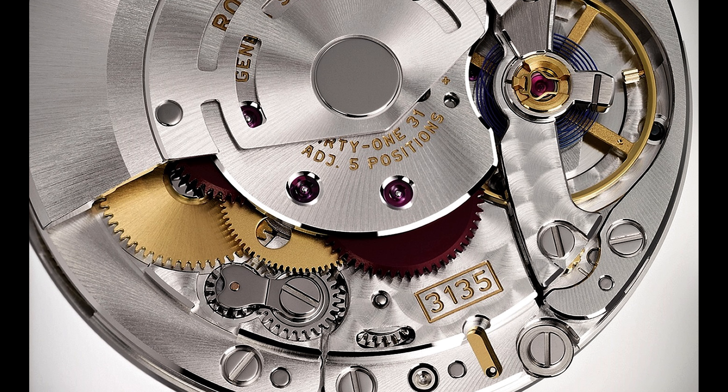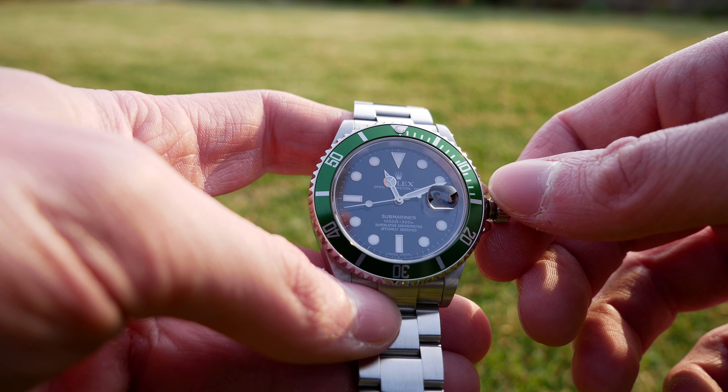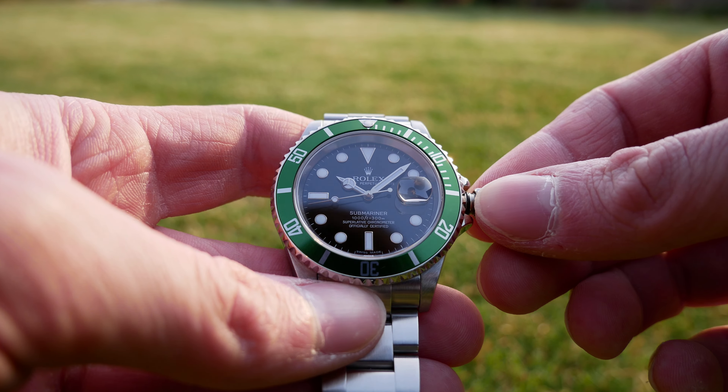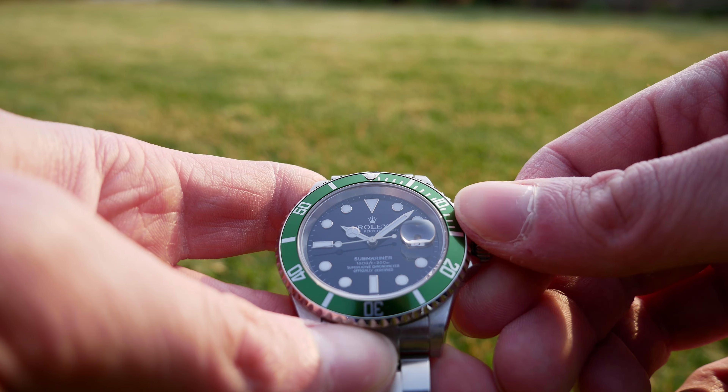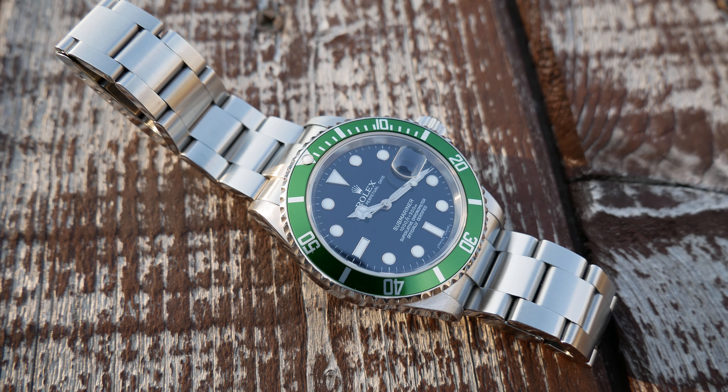The movement inside this Rolex is the in-house caliber 3135, a proven 4 Hz movement with 48 hours of power reserve. This movement is COSC certified and is known for its ability to keep great time for many years without being serviced. I have to say that crown operation on this watch is a bit of a disappointment — setting different crown positions is quite fiddly and smoothness definitely doesn't match other premium movements I have tested, like the Omega 8500, 2500, or Eterna 3901. This movement is now being slowly replaced by the new 3235 with 70 hours of power reserve, found for example in the Datejust 41.